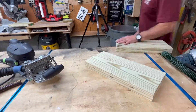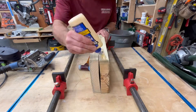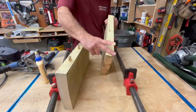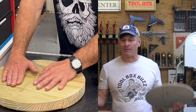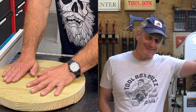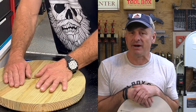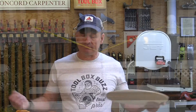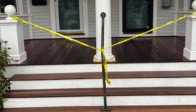After all three bases were made, I ran them over to my router table with a round-over bit and rounded them over on both sides, then sanded them. I made the square base on-site with some pressure-treated two-by-eights, mitered them, glued and screwed them together, epoxied and caulked them in place.